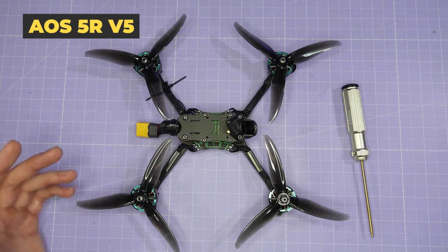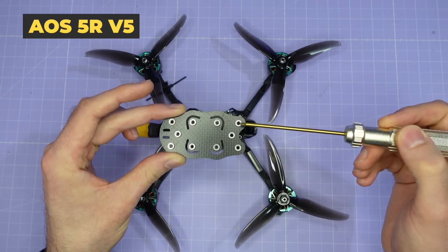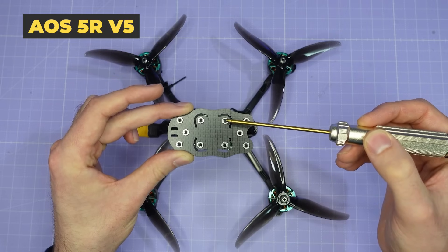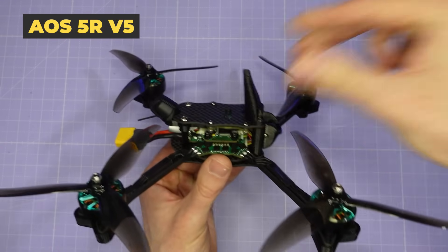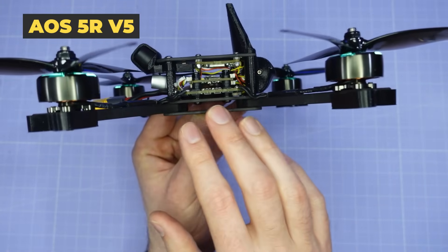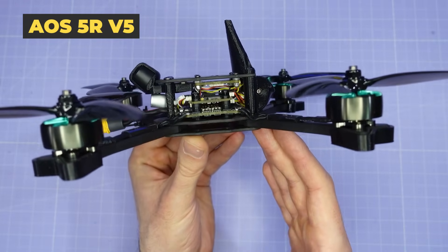In terms of the electronics mounting, we've got press nut reinforcement for all the arm screws. You can see the arms interlock at the front and at the rear, and we also have the four M3 press nuts for the stack screws with the AOS XL cutouts. The main advantage of AOS XL on a racing frame like this is simplicity — there's no need for any stiffener plates or anti-wiggle plates to give the frame exceptional vibration performance. AOS XL takes care of everything, which means this frame has just seven carbon parts and is super simple to build and maintain.